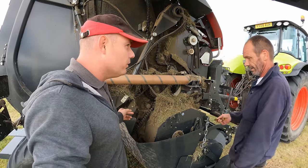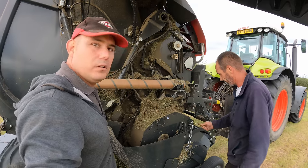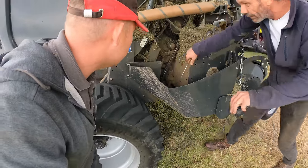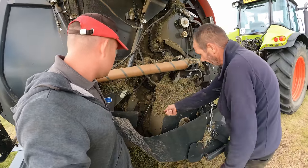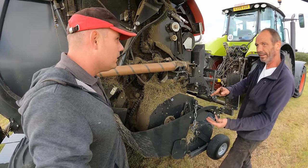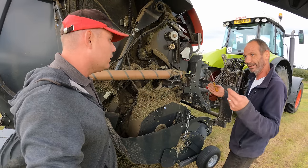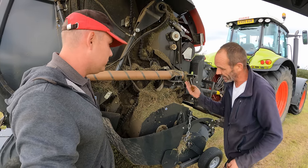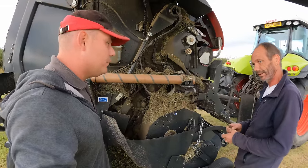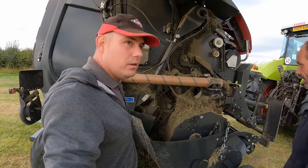What's the drop floor? Let's talk about the drop floor. All it does is it lowers on those cylinders - it just lowers the feed intake floor out of the way so the bale can go into the baler. So you can draw it in, then once it's gone in you snap that back up and away you go again. It just stuffs it into the bale instead of - it just goes in.